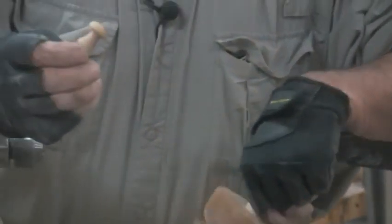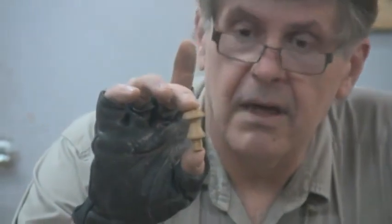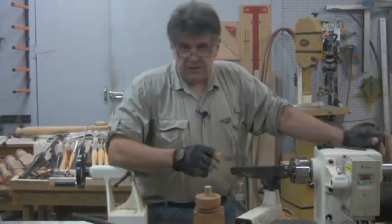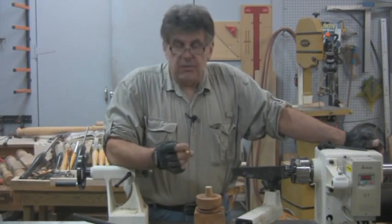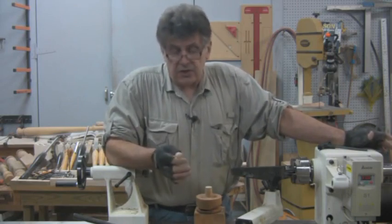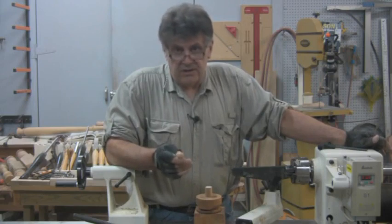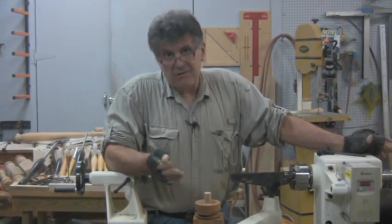But then you take something like this little shaker knob, now it's an end grain. There's a reason. An end grain where you've got the little teeny tenon turned on it, when you put this into a piece of furniture, you want that end grain so when you pull on it, it has more strength. But that also presents you a little bit of an issue because all the faces of your knobs or pulls are going to be end grain, a little tougher finishing. Now here's a trick, sand them up super slick. But the other thing we can do, we can actually reinforce this and make it a face grain turning, but yet have the strength of an end grain. How do we do that?